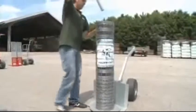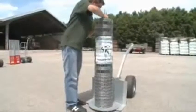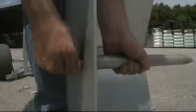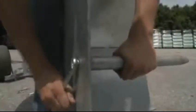If you already have a transport blade, you may also upgrade the same into a fence winch. For this purpose, you need a hole in the centre of the transport blade. The distance to the back wall of the transport blade must be slightly more than the radius of the large rotary disc. The centre piece is inserted in the existing hole of the transport blade and fastened with a bolt from the bottom. Then put the smaller plastic disc and the larger rotary disc on top of that. That's it.